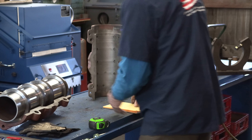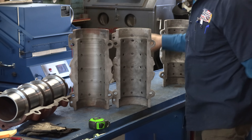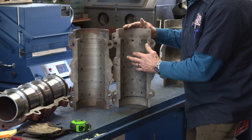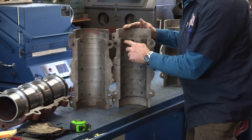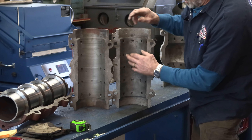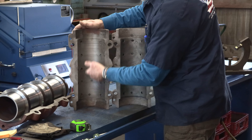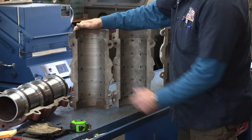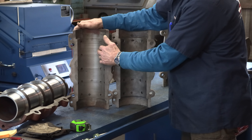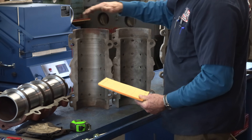I wanted to show you now that we got these blasted and cleaned up. You can see this is an untouched surface — this is how the bearings are supposed to look. This is the rough casting, and these grip ports or holes that are in here are cast in. They actually have a larger bottom than the top opening, so they're like a dovetail plug in the opposite direction — you can't pull them out. This bearing has been run; it actually had zero Babbitt to speak of in the lower half, because the wear and rubbing of the shaft into the housing created enough heat — and that's where you get into the temperatures of Babbitt.